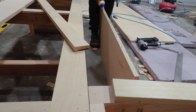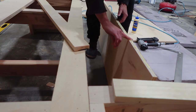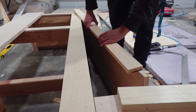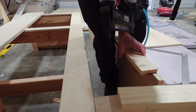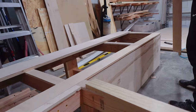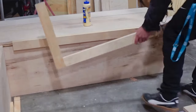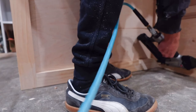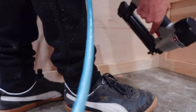For the top piece of the face frame, I'm attaching it directly to the bench top instead of making it a full square, because I want to use it as a handle for the bench top. I did this with both bench tops — the long piece and the short piece — and the same thing with the framing, both of which I brad-nailed to the plywood directly with two-inch brads.